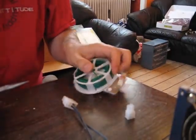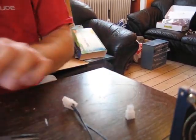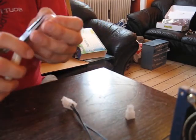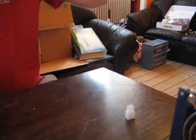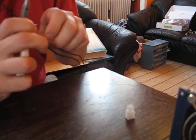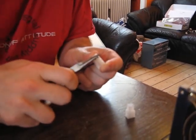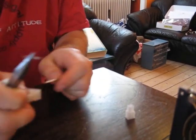So I got 2 plugs here. Now, how did I remove the wires, which I am going to add again? This is actually an important thing I wanted to show you. You can get these — they are used to bind flowers, but they are also great for binding cables. I take the plastic off one of them and just bend it. The reason I am using this piece of metal is it is extra thin, so I can use it to release the connectors in a way so I can reuse them. I put it in one side, push it to one side, into the other side — and there we go, it's off.